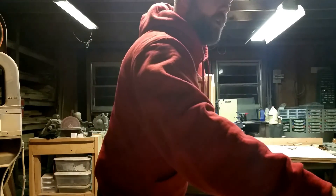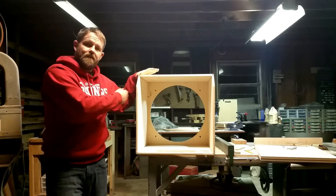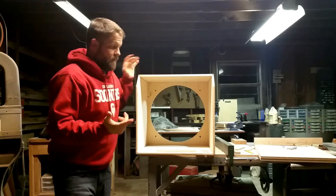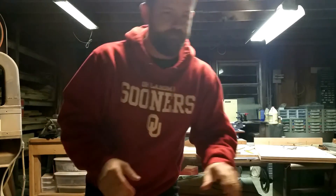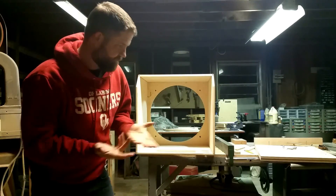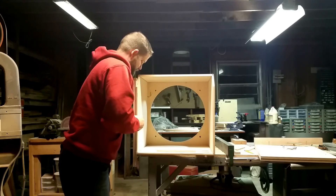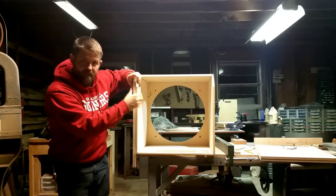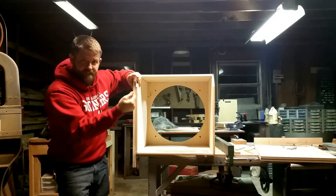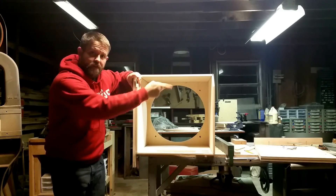The reason I didn't go all the way through on those spots is I don't want tear-out on the other side of the mirror box. The way to alleviate that and not get any tear-out: I'll take a scrap piece of wood — I want a relatively small piece of scrap — and I'll look and see where those holes are, then clamp this really, really tightly on each side of the mirror cell as I drill those holes through. That's the way you're going to avoid tear-out. Clamp this on, finish those holes going all the way through on your mirror box, and you're ready to go.